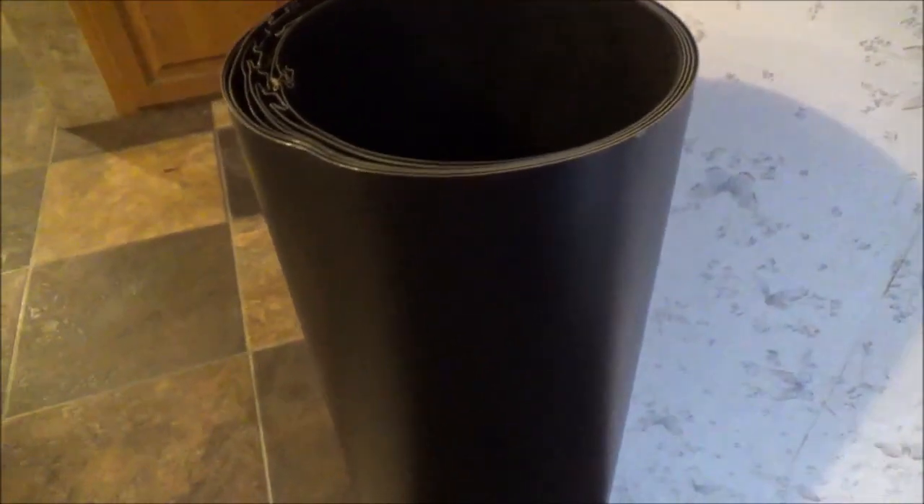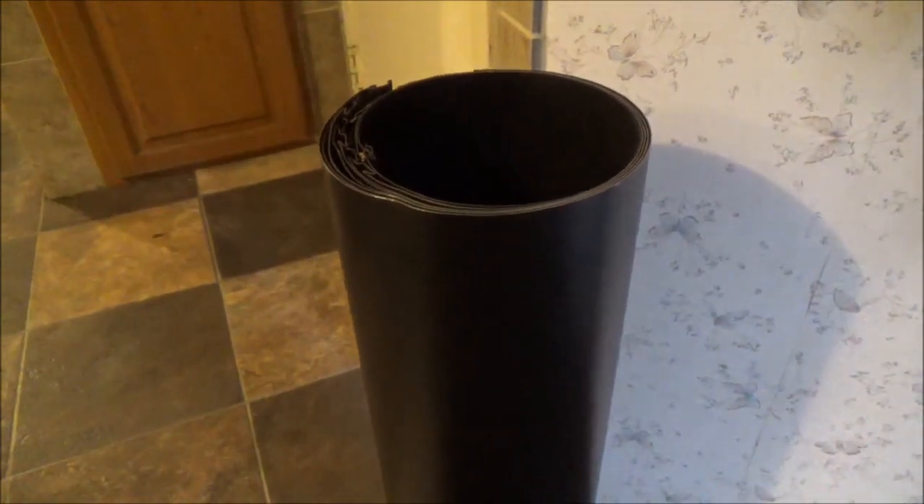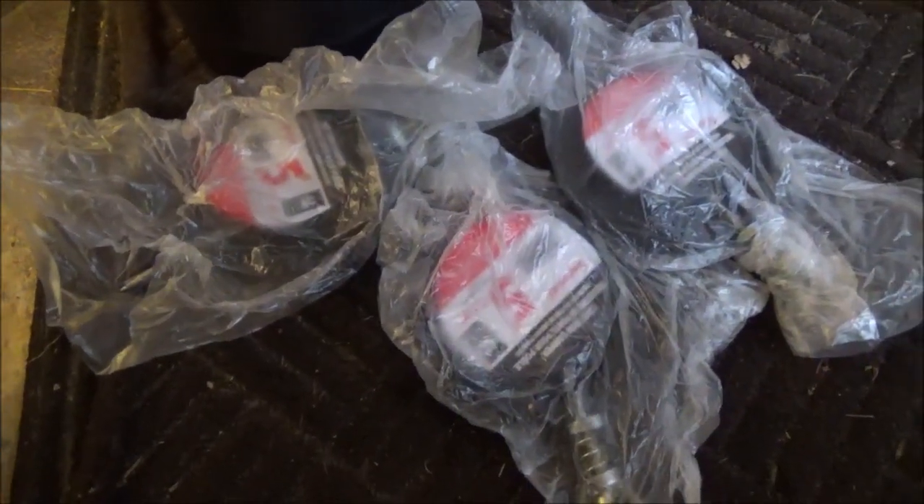I did go ahead and order the black real wood stove pipe. It's much thicker than the metal stuff I always use up there — just stuff you buy for duct work. So this should last a lot longer. I also ordered three five-inch dampers. I like to have them on hand. Six inches are easy to buy; five inches not so easy. I know a couple stores that carry them but this time I just ordered it. I'm really picky about my damper — when I put it in the stove pipe it's got to be straight across. I can't stand it when it's at an angle, so I measure it and drill it. But if I screw it up and get a bad damper I'm not happy with, I will toss the pipe and do a whole other setup, because you have to fight with that for fire after fire.